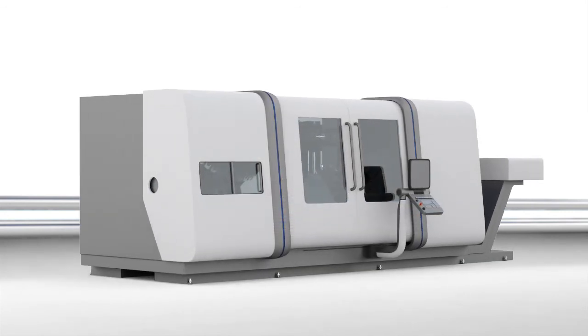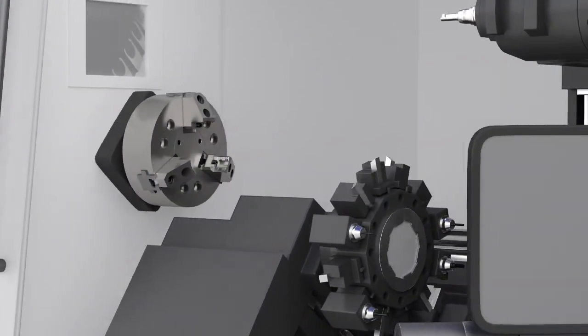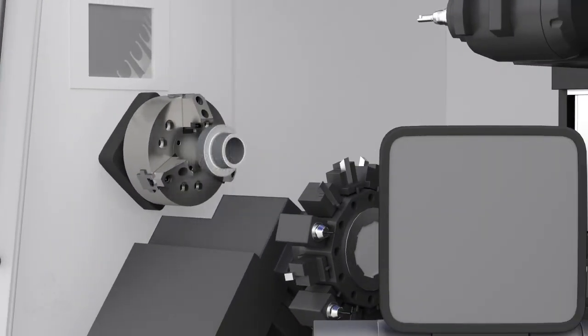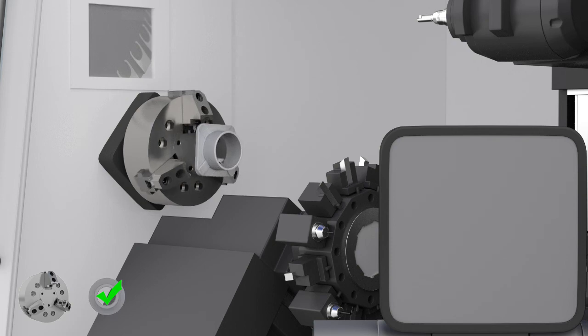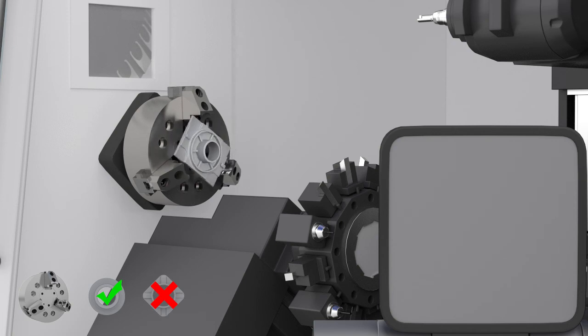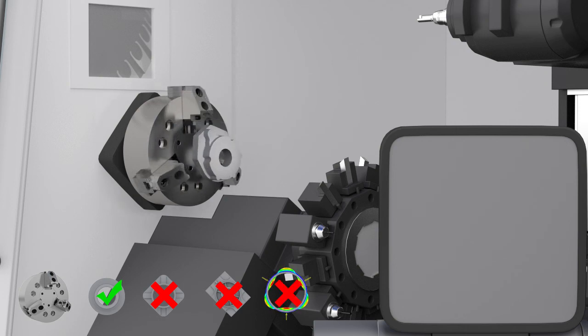Up to 80% of modern CNC machines are equipped with rigid concentric clamping three-jaw chucks. A three-jaw chuck is suitable for clamping round component geometries, but when it comes to square or cubic shaped parts, it's impossible to get them clamped in a three-jaw chuck. Thin-walled parts get strongly deformed in a three-jaw chuck. Asymmetrical parts can only be clamped with the help of special solutions.